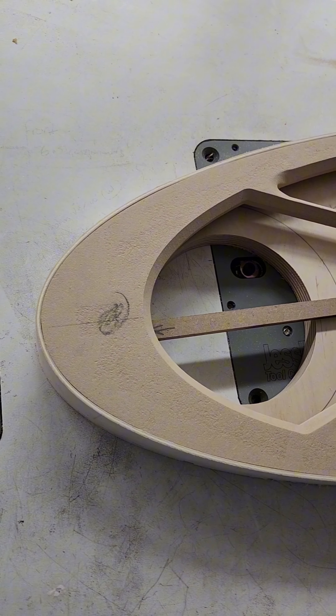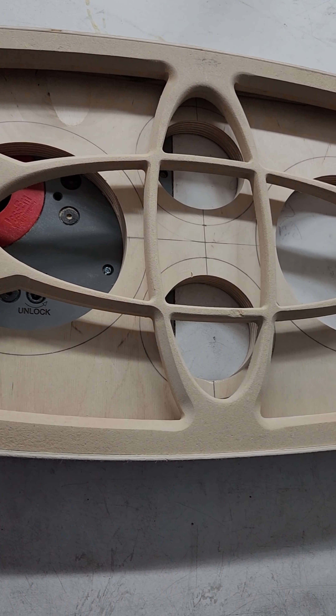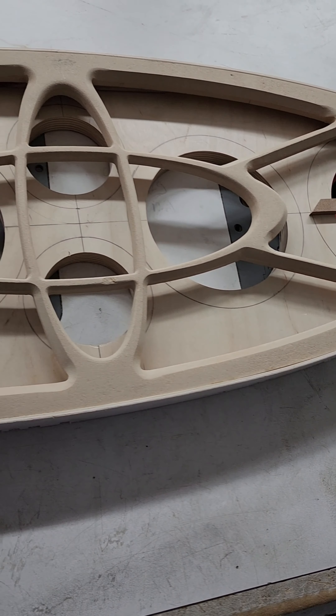You saw me using a few different bits there — I explained the small chamfer and then the mini round-over to get the look we wanted. After that, the transition from the rounds to the 45s is never going to be perfect — it's just not going to happen. What do you do? Sand it. Nothing crazy — not sanding for an hour, just a couple of little spots to touch it up and make sure it looks right.